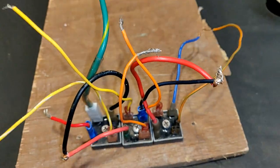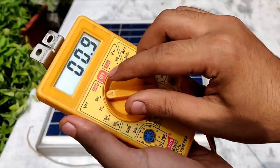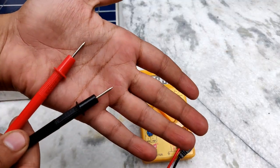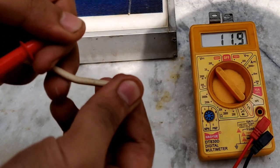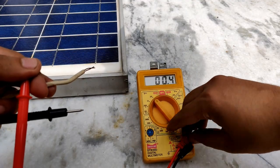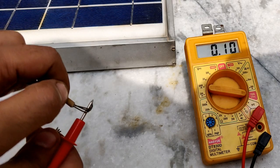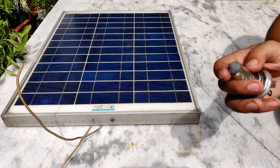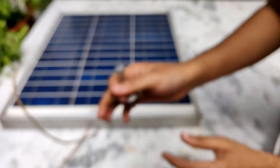This is a 38-watt solar panel. I'm going to measure its voltage — the meter is pointed towards 200 volts DC mode because its voltage is going to be more than 20. As you can see it's 20.1 volts. Measuring its current — this panel is very old, almost 8 to 9 years old, and it is still producing 1.5 amperes DC. This is a 60-watt 12-volt car headlamp bulb, meaning it will take somewhere around 5 amperes from a DC source.